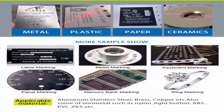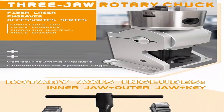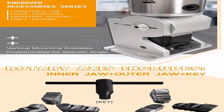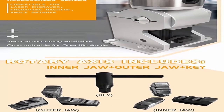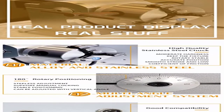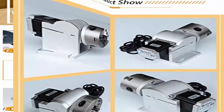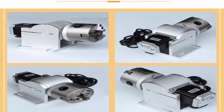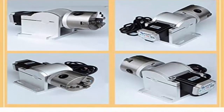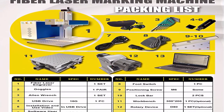Control board, BJJCZ board, original EZCAD2, compatible with Windows XP, Vista, 7, 8, 10, stable performance and high reliability. Updated to JPT Freely Laser Source, JPT LP Plus Series. Repetition rate frequency, 1 to 600 kHz. Pulse duration, 200 nanoseconds. This rotary fixture is mainly for small hardware such as rings, bracelets, cigarette holder, pen, syringe, etc. Rotary spring clamping, fast mounting and dismounting to improve work efficiency.